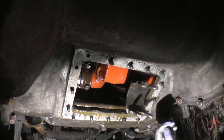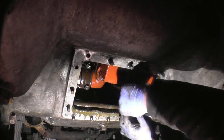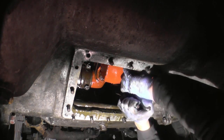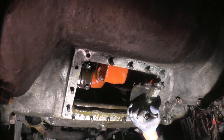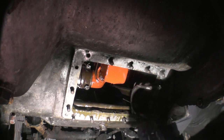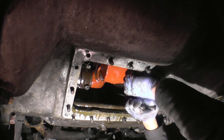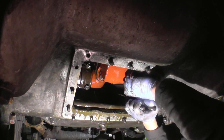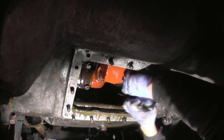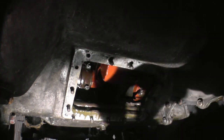Something not right here. It's going in too easy. It's going together too good. John, can you go around and have a look, see where the piston rod is, please? Has it gone in between the glands yet? Yes. How far in is it? I can't see any threads. No, you won't, will you? I can't see the join. It's new material. Brilliant, that's it, we're through.